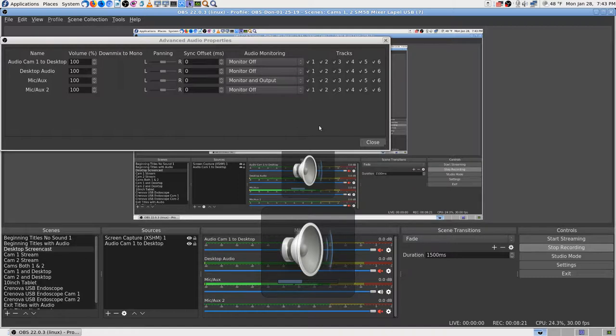Check 1, 2. It's going to feed back real easy. That's the high-end feedback, feeding back on my mic, so I can't turn it up very much. Check. I can barely hear that low-end rumble. I think I'm going to try turning down the gain, because usually I don't use that much gain on the mixer itself. Check 1, 2. Hello, check. Okay, so I might have fixed it, and my signal still seems okay.